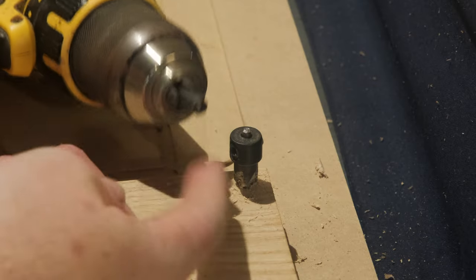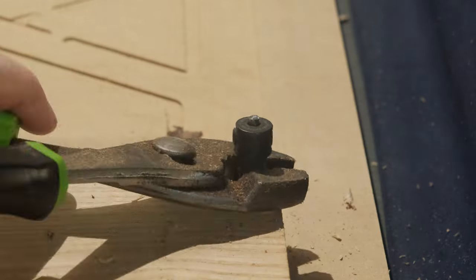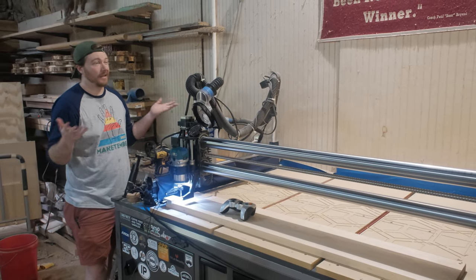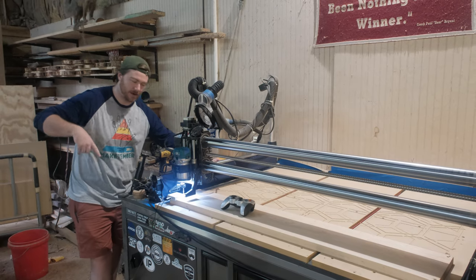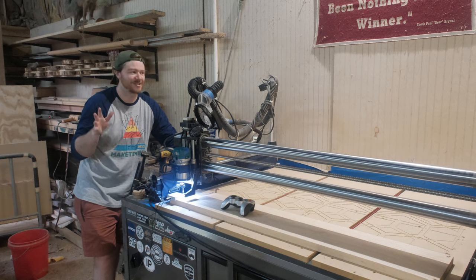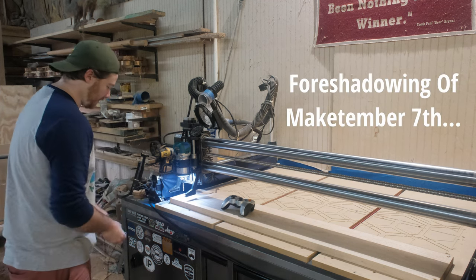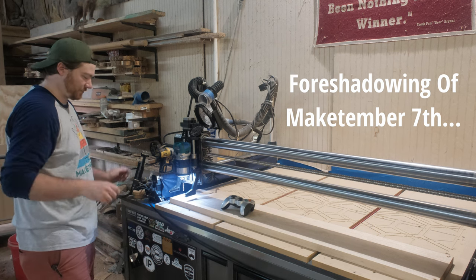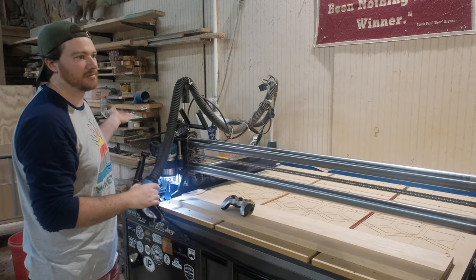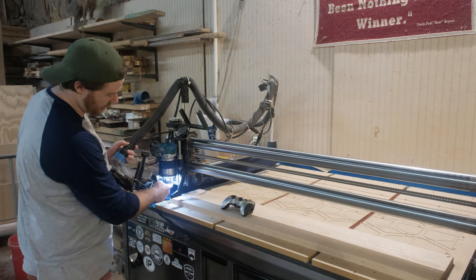One second — it just snapped off right there and it's the only one I've got in the shop. I remembered yesterday that I hadn't taken the bit out of the collet and I'm about to do a two-hour long carve. So I took it out and sawdust just poured out of the collet. I always make sure to check that the collet isn't just slammed with sawdust, because what that's going to mean is during a two-hour long carve I could be right in the middle of it and then that bit falls and ruins the whole thing. All it takes is 30 seconds of checking if you've actually cleared out the chips — that is the biggest weakness of this little router. It works great other than the fact that its collet is a no bueno.